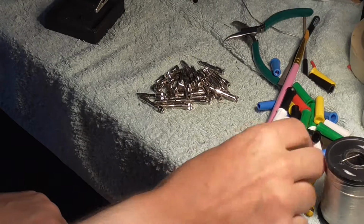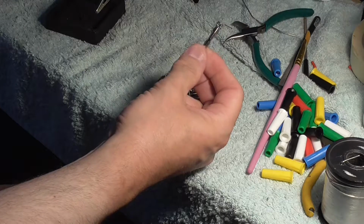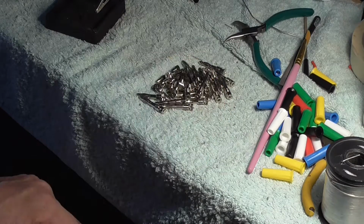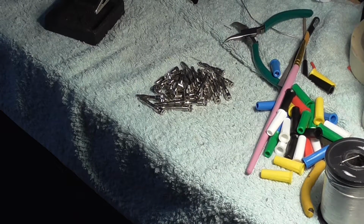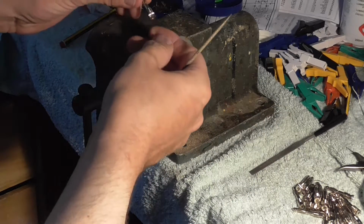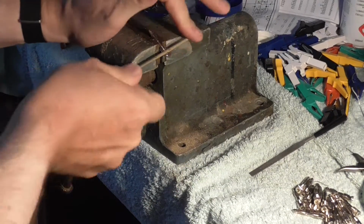Now we got our coloured banana plastic bits separated from our actual banana pins. So what we need now is get the vise out and we'll start filing and get all these filed down. We'll probably do them in, like, I don't know, 6 at a time, solder 6 up at a time and go like that. Okay, let's do that next. So I'm just doing it. I actually decided to do more than 10, I think. It's going very well.